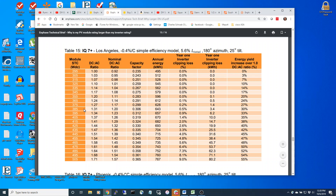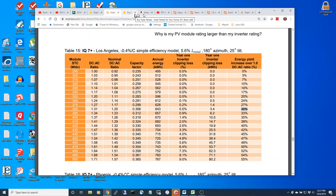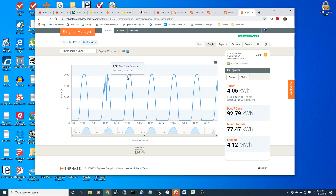You can basically overdrive them, and that's what I've chosen to do. I've got a 385 watt panel and I only give up about 3.4 kilowatt-hours a year. So it's nothing I give up, and I generate way more electricity than the 295 watt limit. I've got 295 max on the inverter, but I'm only hitting my max from about 12 o'clock to 2 o'clock, and I'm not really giving up that much power.